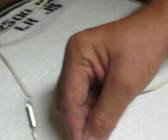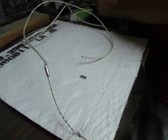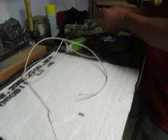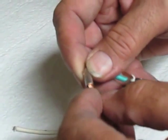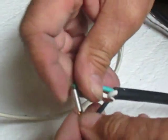The other thing you need is called a butt connector. It's a little tube that you slide one end of a wire in and the other end of a wire in. You strip the wire down, put one end in there and the other end in there. And when you crimp it, it holds the two wires together. That's a butt connector and it's crimped.